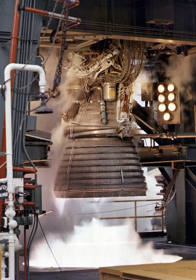The main oxidizer valve was similarly a butterfly-type valve, spring-loaded to the closed position, pneumatically operated to open, and pneumatically assisted to close. It was mounted between the oxidizer high-pressure duct from the oxidizer turbopump and the oxidizer inlet on the thrust chamber assembly. Pneumatic pressure from the mainstage control solenoid valve was routed to the first and second stage opening actuators, together with controlled venting through a thermal compensating orifice, providing a controlled ramp opening through all temperature ranges. A sequence valve within the MOV assembly supplied pneumatic pressure to the gas generator control valve and through an orifice to the oxidizer turbine bypass valve.